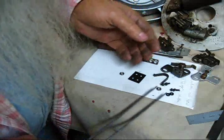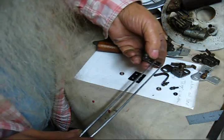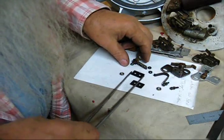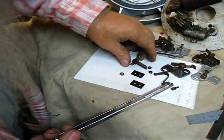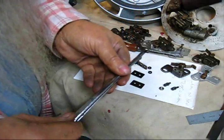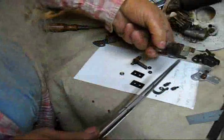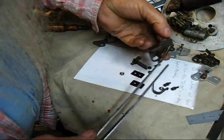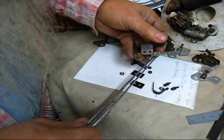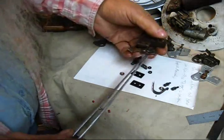These two holes right here are bigger than the bolt that goes in them, and the reason for that is them two little fiber washers right there — those are insulating washers, and they go in that hole right there. You've got two insulating blocks, two screws, two lock washers. Somebody could put stainless steel nuts on this — I kind of advise against it, but if it's all you got, it's a good choice. This spring right here — that's a real nice one right there. We're going to put a set of points together. This is a good candidate to use on the engine. The points are not good but not bad — they've got some issues, I will work them with a stone, but there's enough length there where I can straighten them up flat, true to themselves.